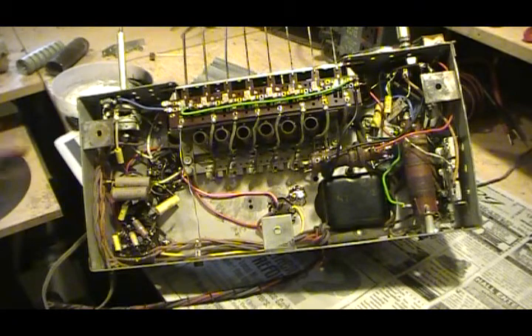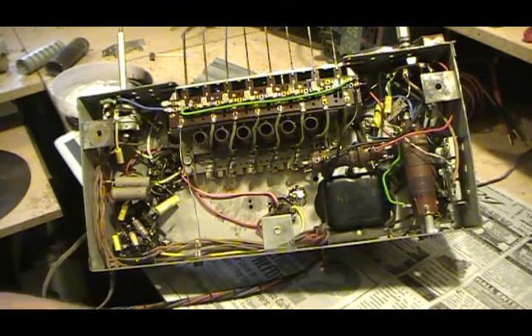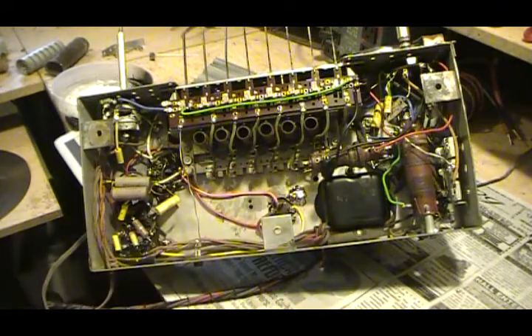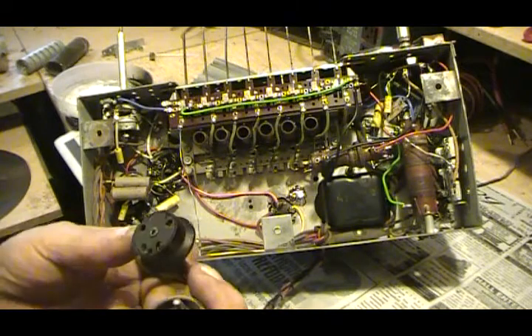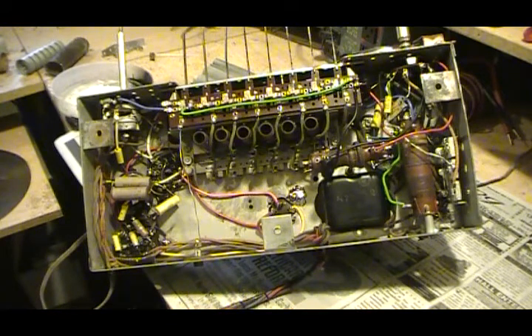Now the next step — I'm working on a speaker. Turned out the speaker for this has an open field coil. So I've got another speaker, but I have to pull the plug off the old speaker — this is the plug that sits on the speaker to plug in here — and I've also got to change the transformer over, the audio transformer. I'll get that done and get it up and working.